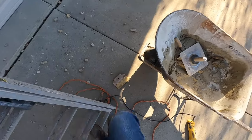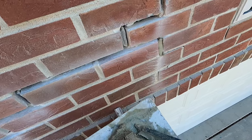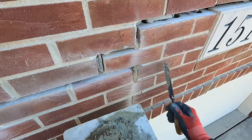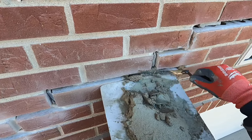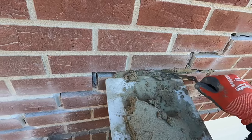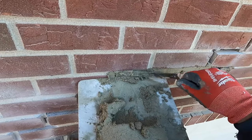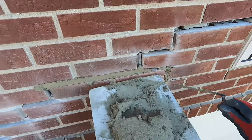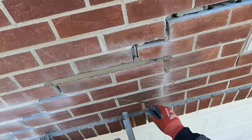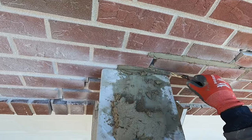What you're going to want to do is grab a little chunk of mortar and start off slow if you haven't done this before. That trowel might be a little too big for that joint, so I'll go to this joint here. You might need to switch off tools periodically if your joints are inconsistent — in this case they are a little inconsistent, so I'll have to use a couple of different joiners, which I don't normally do. But that's just the way it goes sometimes.